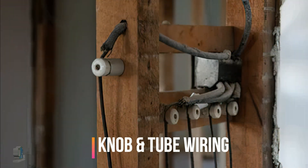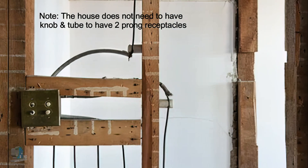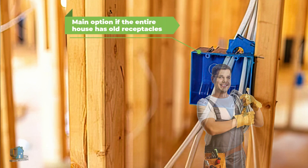There are solutions. If there's an older house with knob and tube wiring and many two-prong receptacles, one option is to run new electrical wires with ground to new receptacles. We advise you get an electrician to evaluate your situation.